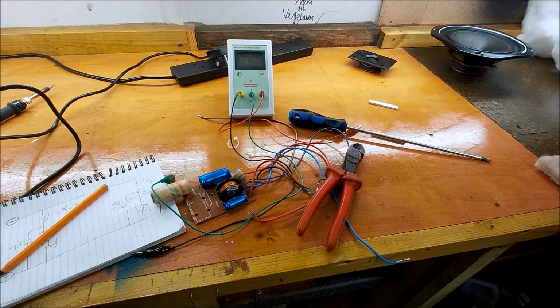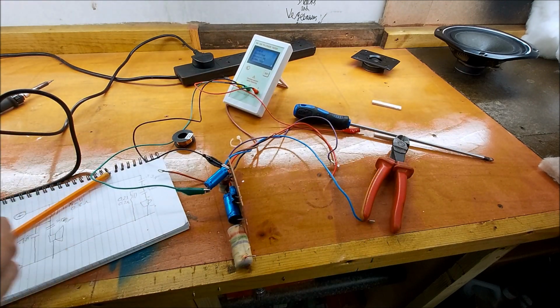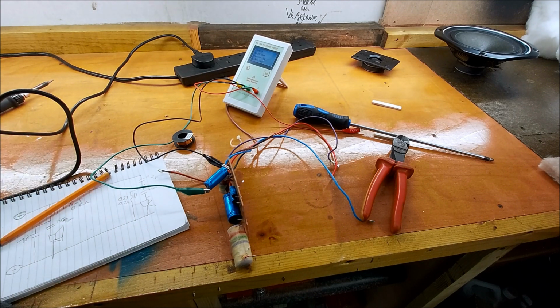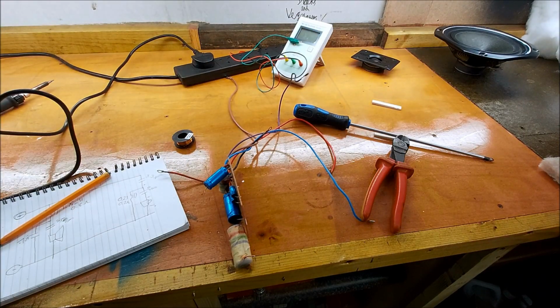I'm not going to spend any money on these. Hang on a sec. Right, so the 3.3 tests more like a 3.6, and this measured quite well. I have some 3.9s, and a 4.7 with an inductor in the middle, same value. Yeah, okay, let's do this. We might push the crossover frequency out ever so slightly. I think ultimately we're gonna be better.